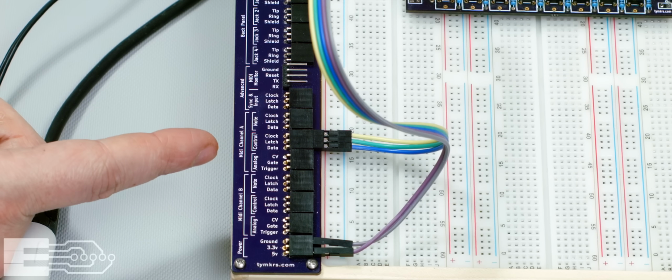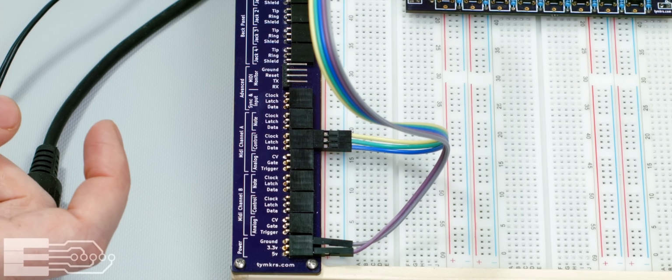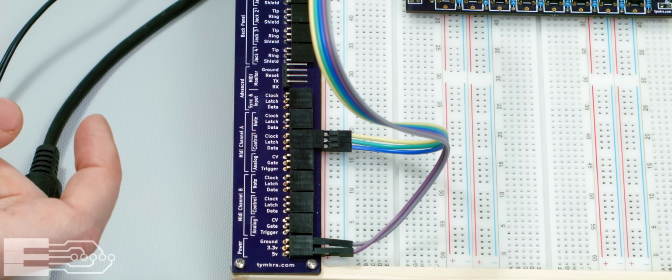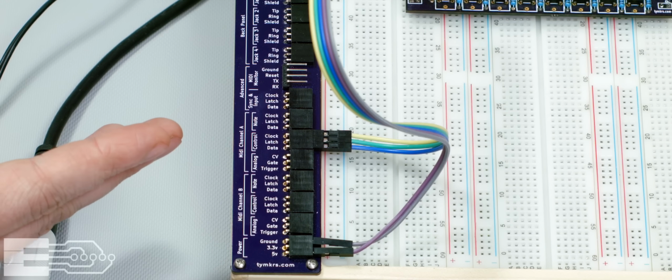And what comes out of this port is every single control value on that MIDI channel, its value at the moment, in binary, 7 bits at a time. And there are 127 of them. So the first one that you connect here ends up on control 1.